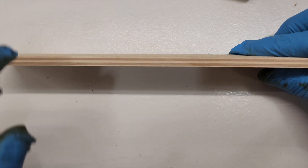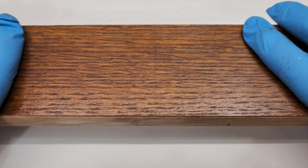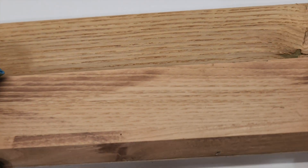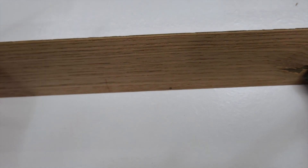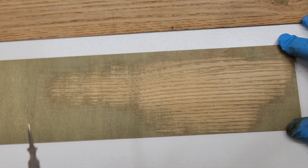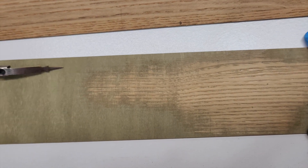It's not very different at all from modern plywood. Here's a thicker piece. So what we can do is slice it, get rid of our core wood. Then you can see we've got just a little of the core wood left, our cross banding, and then of course our veneer. If we sand that, here's what's left of the core wood, here's our cross banding, and our veneer.